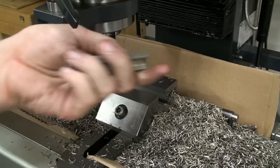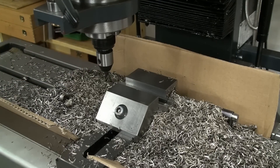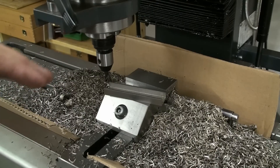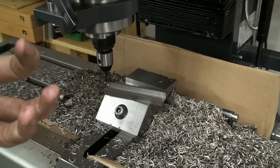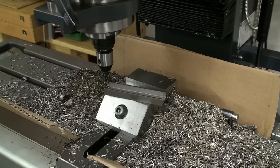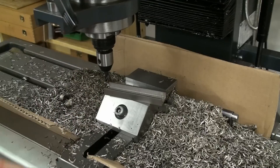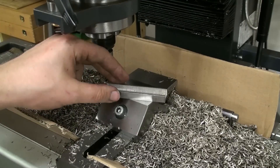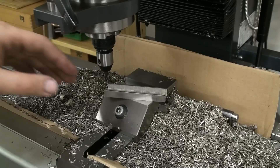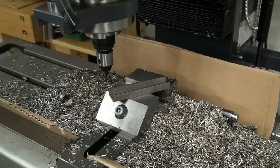The part is also only hand-warm. When I tried the 6 millimeter roughing end mill before, the machine ran much rougher, tended to vibrate and chatter, and the chips were packing up behind the cutting edge because chips from a roughing end mill are very short and compact — they get pressed together. These chips don't compact as well, and the flutes of the end mill pull them out of the slot. So in this case, a normal end mill with a 45 degree helix angle works way better than the roughing end mill — surprisingly.